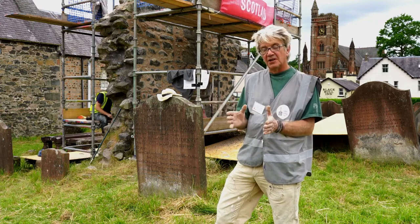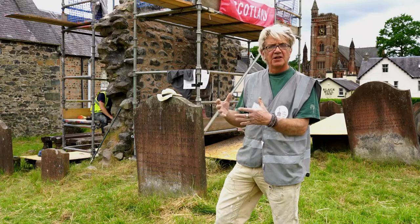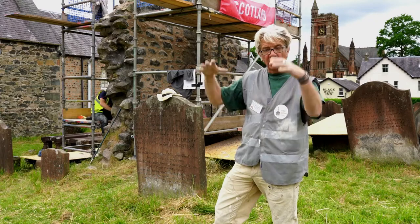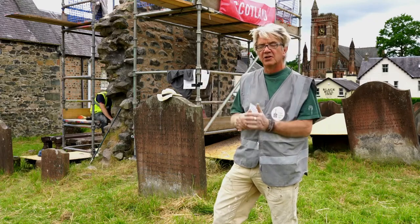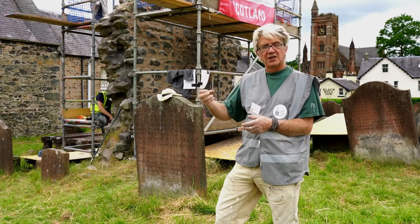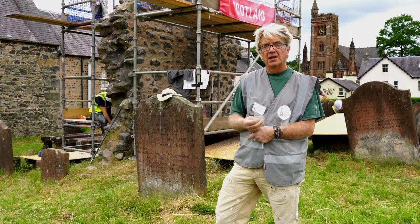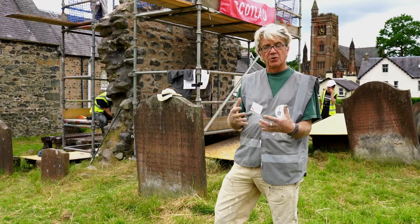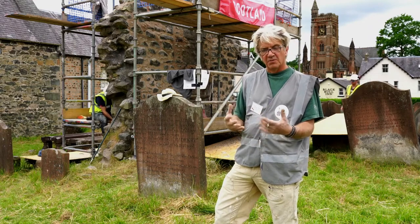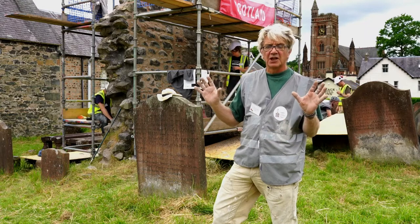The other reason is that they're capillary active, so moisture that gets into them, which is not as much as people think, except on the tops, obviously, where they're getting wet all of the time with no protection. That capillarity means that the moisture that gets in moves out very quickly, which makes them less frost vulnerable because it's gone almost as soon as it's received, but also it keeps the building fabric dry routinely. That's what it does. So those are the two.